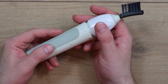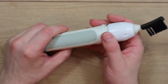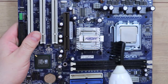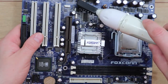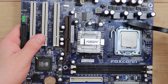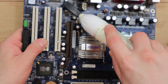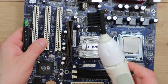I kind of threw this together because I've had this idea for a long time and just kept putting it off. I've also thought about doing this for cleaning PCBs — obviously this particular board doesn't need cleaning — but I thought it might make shorter work of cleaning boards where there's damage. The problem with normal brushes is you've got to really move them around quite a bit, whereas with the vibrating brush you're just guiding it, paying more attention to where you are, being more gentle around things, and you should in theory get a much better clean.